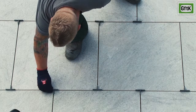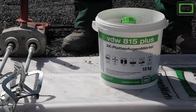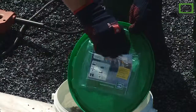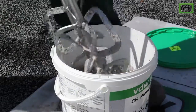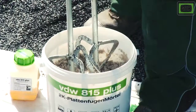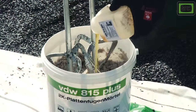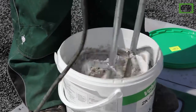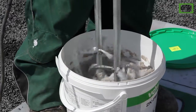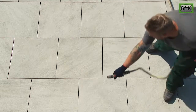Spacers may only be plugged from above into the joints, so they can be easily removed again before grouting. In the bucket you will find the components of the mortar as well as a booklet on the lower side of the lid, containing all technical information and instructions about the epoxy paving joint mortar for flags and slabs. Thoroughly pre-mix the aggregate mineral compound in the bucket with the twin paddle mixer, then add the binder from the bottle — make sure the whole bottle is emptied into the bucket. Both components should now thoroughly be mixed until smooth and homogenous. No water should be added to the mix. Fully saturate the paved surface before starting the application and ensure this condition is maintained throughout the work, as this eases the jointing and prevents the mortar from sticking to the surface.